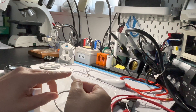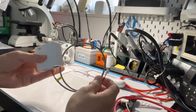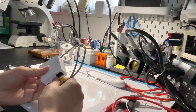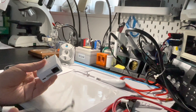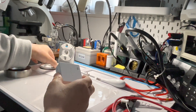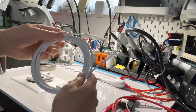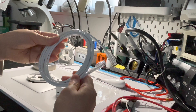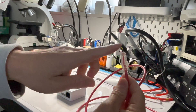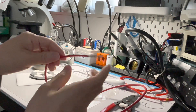The connector is on the down side — connect here, just like this. So if you get the adapter for the first time, you will only get these things. Sometimes, such as with LG, you do not need the cables, so you will only get the adapter. To connect the adapter with the Nest base, we need to use a CAT6 cable. You can make it yourself or buy a whole wire from the market, then cut one side — because on the Nest base side, we do not use this connector. We just use the wires to connect the base directly, so you need to cut it.